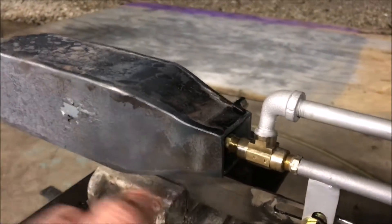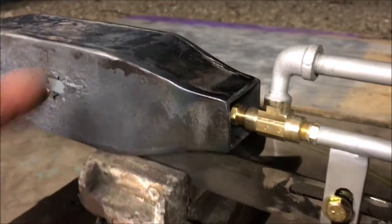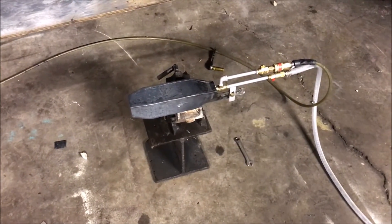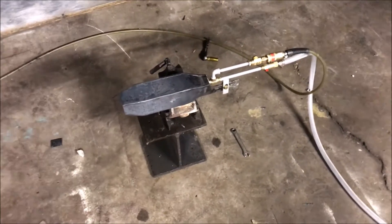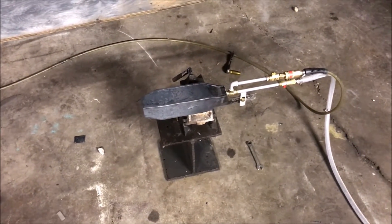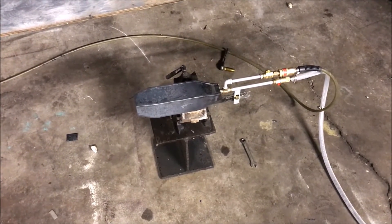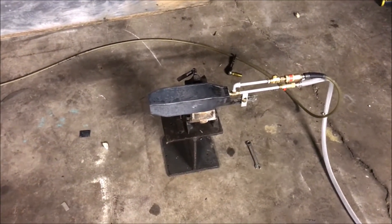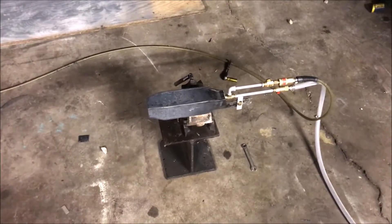A vortex difference and the flow is definitely going to take place. You've got a high-speed jet flying this way and low-speed laminar flow on the exterior from the Venturi effect — so you're going to get a rolling wind pattern in there. Where that rolling wind pattern takes place is definitely going to determine whether or not you're at an optimum combustion setting. It was definitely very loud when it was resonating — so loud it was going right through the earplugs.